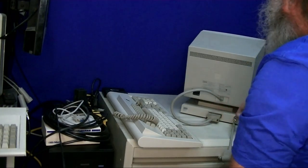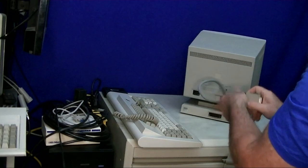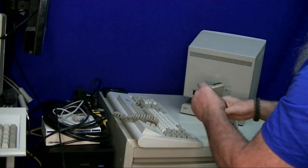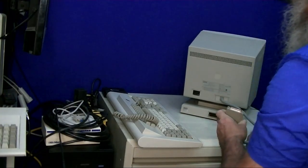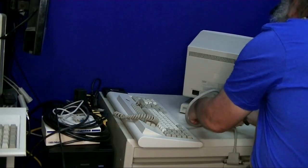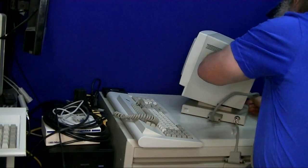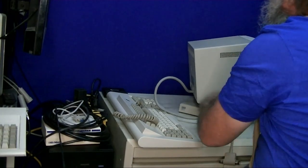And we've got a 25 pin connector, male, or should I say, I guess it's a socket and plug if we use the non-gender identification, but there it's got the DB25 connector that goes between the video and the logic element. That cable's pretty thick. It's not able to really bend all that much, but it does allow moving the video element to all those locations, even kind of to a side effectively.